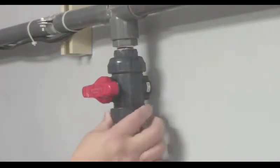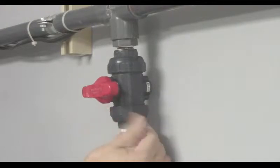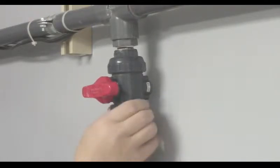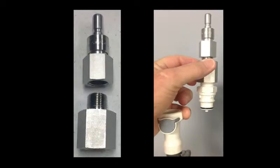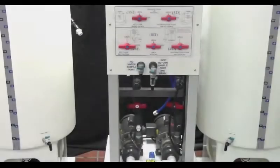Install the provided CPC male quick connect fitting to your purified water source. If you have a Marcor heat disinfect system, remove any flow restrictors from the feed line and install the optional stainless steel fitting to the water source. Place the system plumbing frame directly over or as close to the floor drain as possible, making sure it is within 6 feet of the purified water supply valve.